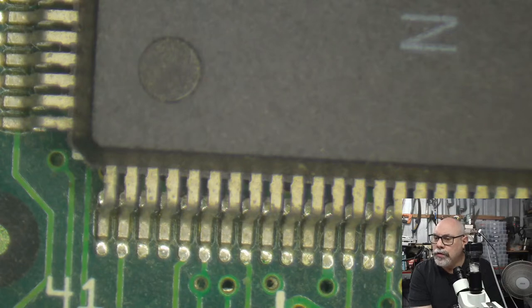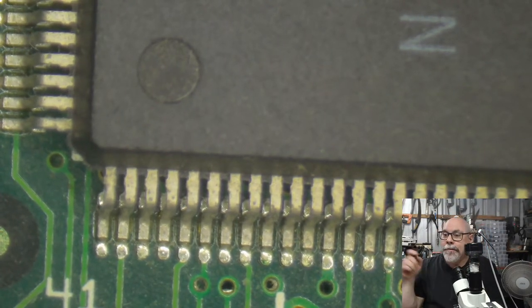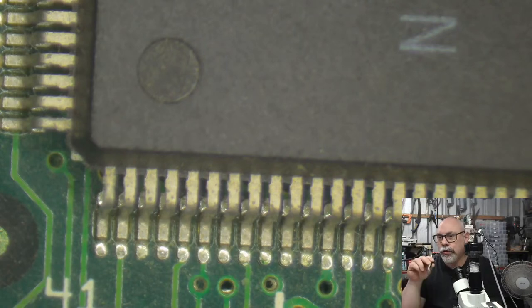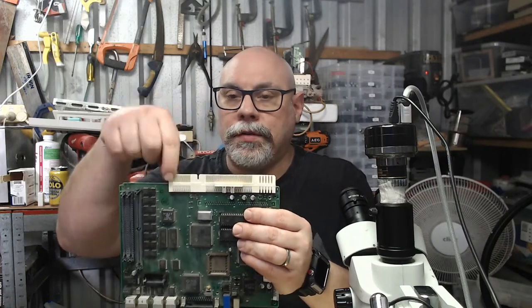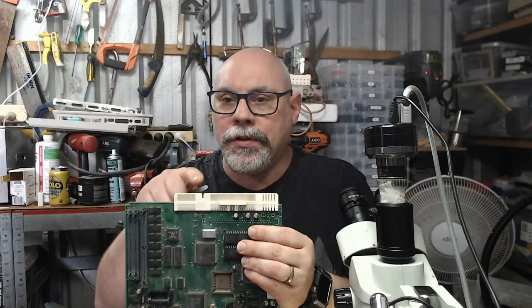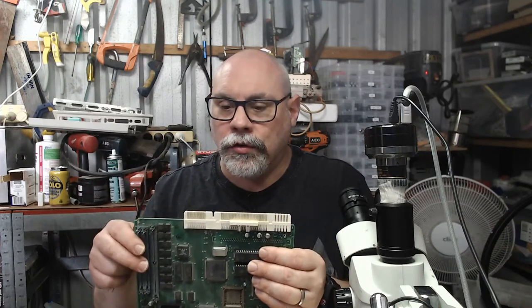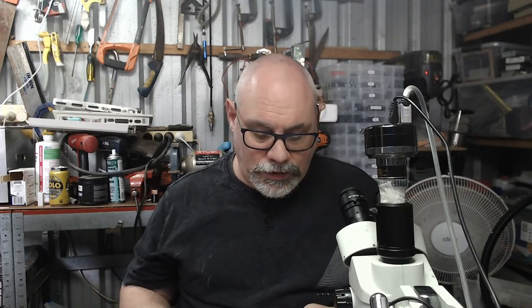Yeah, okay. No, that's an interesting one. If it's not getting power at all, look, there are lots of things. The floppy drive connects to the little connector that this plugs into. So when you plug this into your computer, the floppy signals are coming out of one of these pins. I don't know which one. You could look at the schematic and find out which pin is doing all that. But if it's not doing anything, the chances are it's not getting any power at all, no voltage at all. It could be an issue with some of these pins, it could be the cable. There are lots of things along the way. But if you're absolutely certain that floppy drive works, you kind of have to trace it back from the source, I suppose.